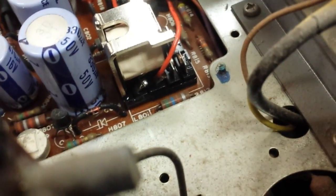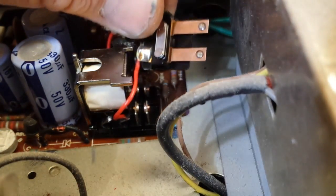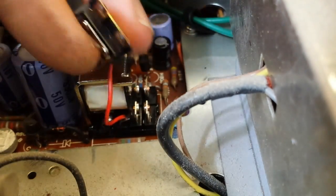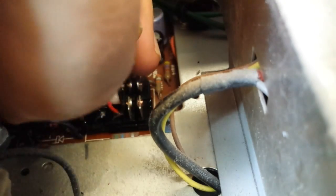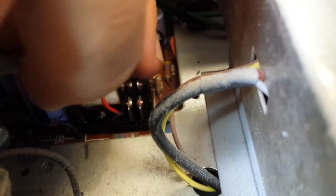I'm trying to do this in such a way that you guys can see what I'm doing. So there are our contacts, and here's the back side of them which look ugly and burned. I'm just going to take our sandpaper — this is a 2000 grit — and just resurface it. See how it makes it nice and shiny and pretty, no more carbon and junk there. That's important to do, otherwise you'll have channels dropping out at lower volumes.